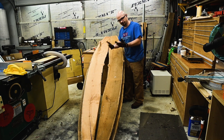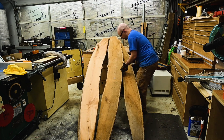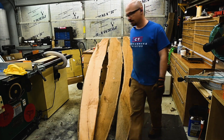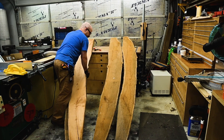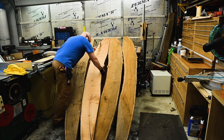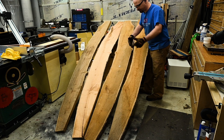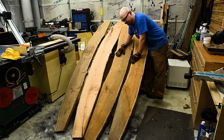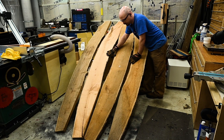It's almost a mirror image bookmatch. To keep this more appealing, what I'll also do is put the ones on the outside — I'll just pull straight out — and that is the orientation that these slabs will be in. You might be thinking that looks cool, but what are you going to do, fill all that with epoxy? That would be kind of gaudy. And once you rip straight boards out of these, it's going to be pretty narrow. I've got better ideas than that. But first step is going to be bringing the middle together.